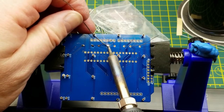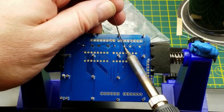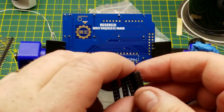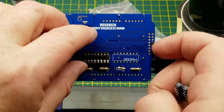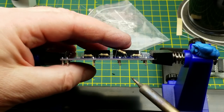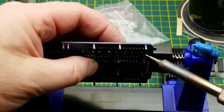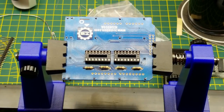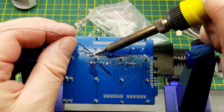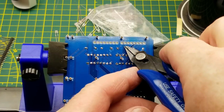Like I said at the beginning, this is the easy part of the kit — something that doesn't bother me at all. It'll sort of build my confidence up enough that I can get overconfident and screw up royally when I get to the upper part. Next in are the IC sockets — two IC sockets — they just drop in with the notch properly oriented. That resistor was a bit ugly so I fixed it. Soldering up those sockets and trimming off the wayward resistor leads.